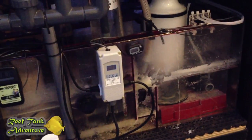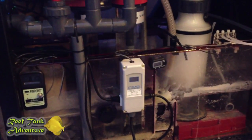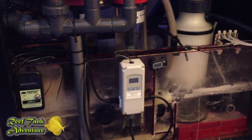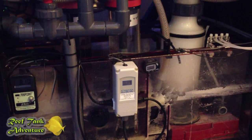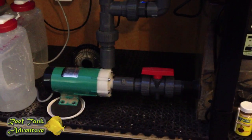You may have a sump pump that is in your sump — maybe a mag drive pump that simply plumbs up using vinyl hosing. That is a very common setup and if that is the case, you are probably going to be able to take corrective action during a pump failure more easily than I was.